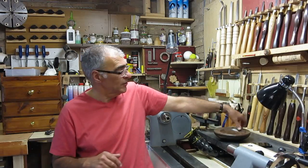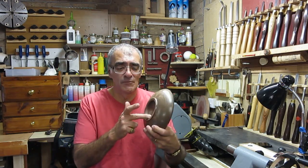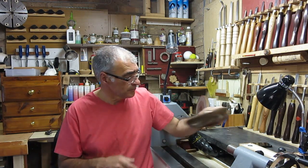The most important thing was an alternative method of actually mounting the bowl for turning, and quite a few people said, oh, we'll try it, and to save the wastage, we have the bowl there, making a deep hollow in the foot would be to use a glue block. Now, my initial reaction to everybody that said that was, I wouldn't advise it, because I don't think that a glue up situation would be man enough to handle the off-centre part of the turning.